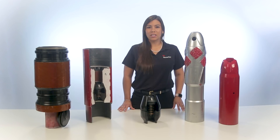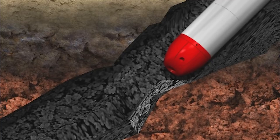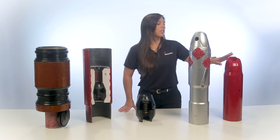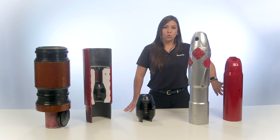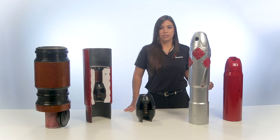Float Shoes and Collars have check valves that prevent fluid from entering the casing. Conventional Float Shoes guide casing past ledges and obstructions to the target depth and also serve as a primary valve after cement displacement. One example is the eccentric nose downjet Float Shoe.